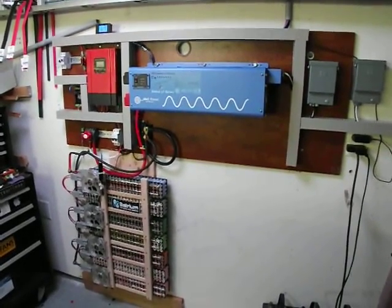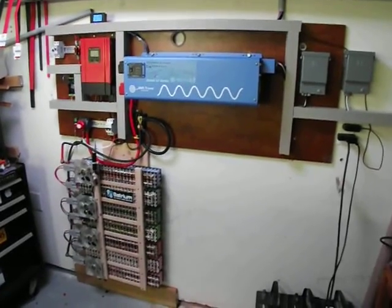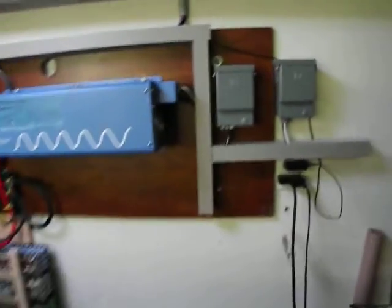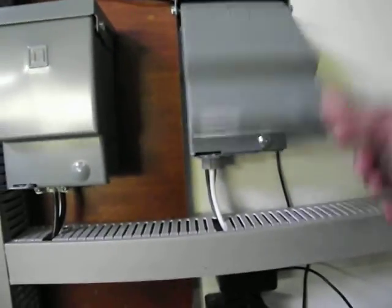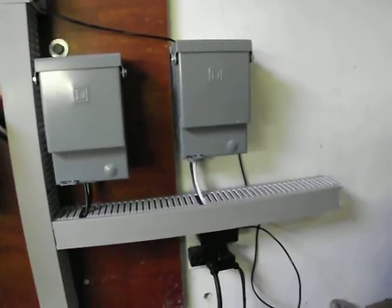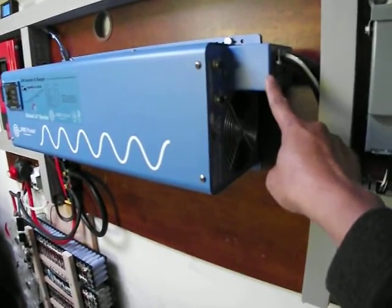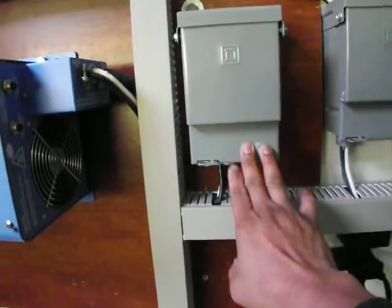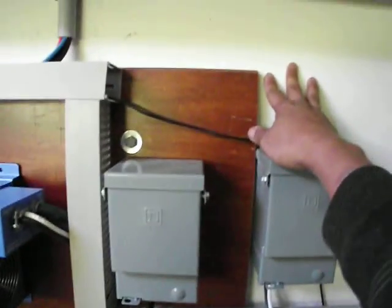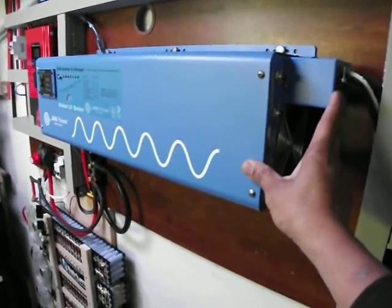This is my system setup. This is my incoming power — I haven't labeled it yet — but this is the 230 volts AC input that's wired into my 6 kilowatt low frequency inverter. This is the AC output that is fed from the main panel in the back. In the back of this wall is my main control panel or main circuit breaker panel, and this is the input that feeds to that input of the inverter.